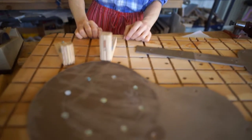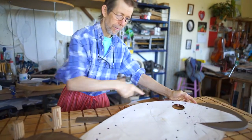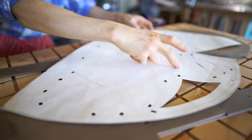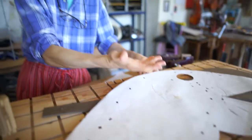Harry Fleischman always cracks up when we talk about how I'm using classical techniques to build these 39-string harp guitars. You can take something like this and just make a Masonite cutout of it, figure out where the doming you want is — the dome was right there — so that section will have a void underneath and you screw that down to the workboard to get a doming. You can adjust the doming for how much tension you want, depending on how soft your wood is, how big your instrument is, or what kind of sound you're trying to get.